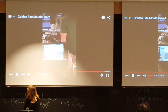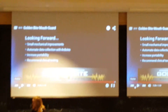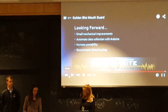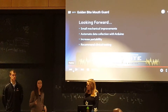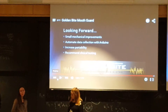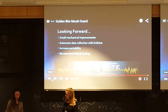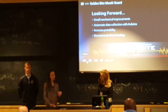That voltage is converted to pounds using the calibration we did. Given more time, we'd like to make improvements to the device, including a sliding mechanism — we think it would be best to remove the threaded rod. We'd also like to add a mechanism to more quickly adjust the variable load so it could be done between tasks without the user noticing. Furthermore, we'd like to automate the data collection using an Arduino board so that it could convert the voltage from the load cell to a force automatically in real time.